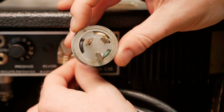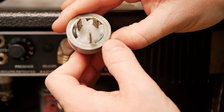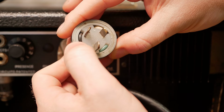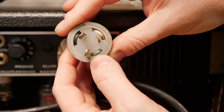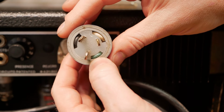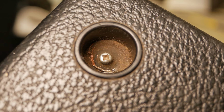And you can see there, this cable has the US wiring code, so black for active, white for neutral, and green for earth. We've got brown for active, blue for neutral, and green and yellow for earth in Australia. I think that's universal across most of Europe, but, you know, don't know. Again, I should have done my research before I opened my mouth, but what's the fun in that? So a little look inside these plugs.